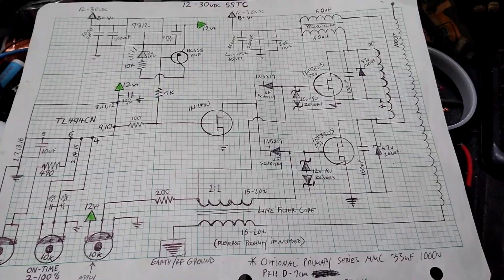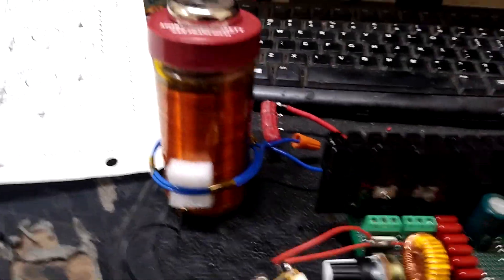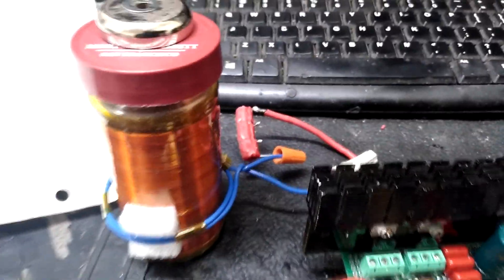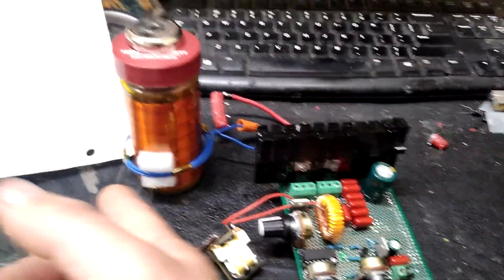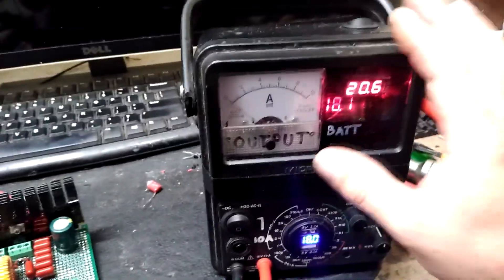It's just like some other ones I've got tuned the same way — you can see it takes right about 30 volts the way it's tuned to jump out with that arc. Before I wind another coil for it, I'm going to try tinkering around with this one some more — maybe two turns, maybe one turn will work even better. I had to play with the coupling a good deal, so if I put it at 20 volts...